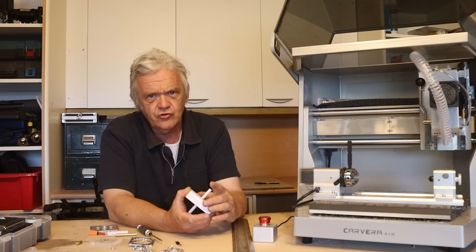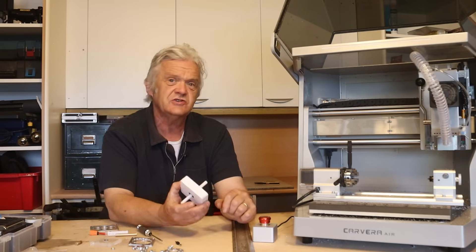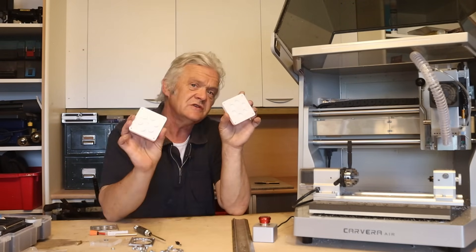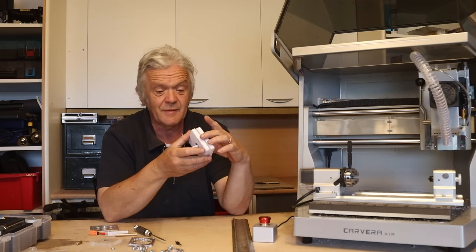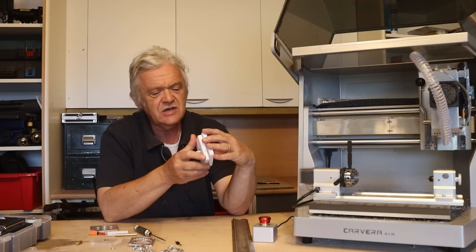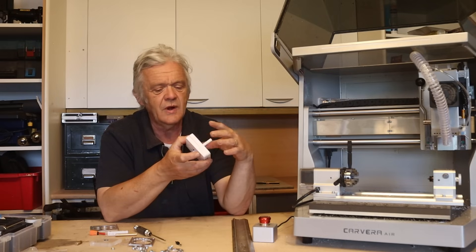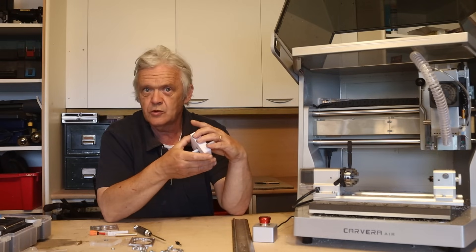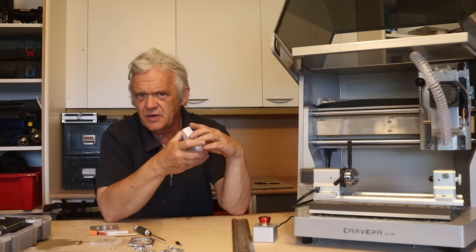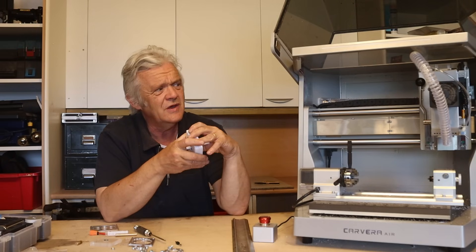What I decided to do was remake this — an extremely compact gearbox. It's a 60-to-1 ratio in this little package, using a perpetual wedge and an eccentric drive, a kind of hybrid drive. It would be nice to see it in metal. This machine works with a huge range of things: plastics, wood, soft metals like aluminium and brass, PCBs, and it comes with a laser head so you can do laser cutting as well — really trying to be an all-in-one machine.